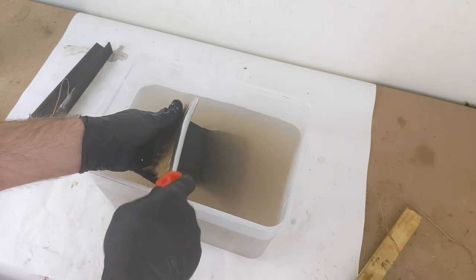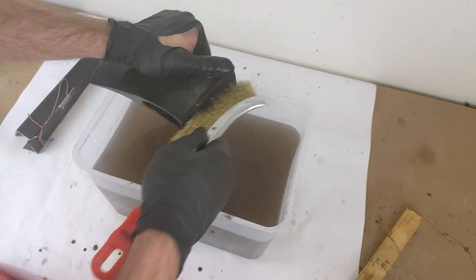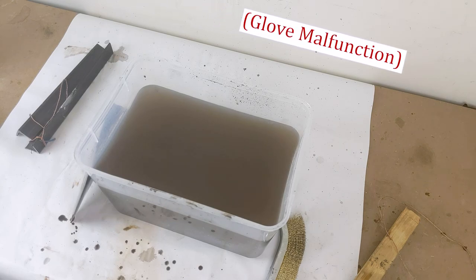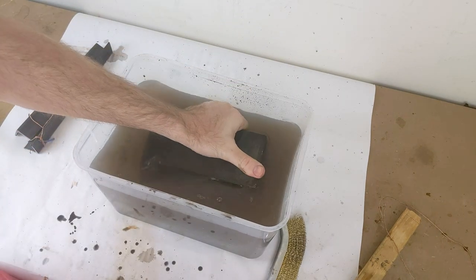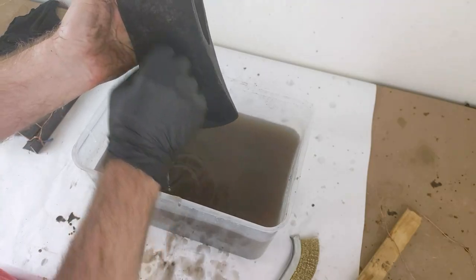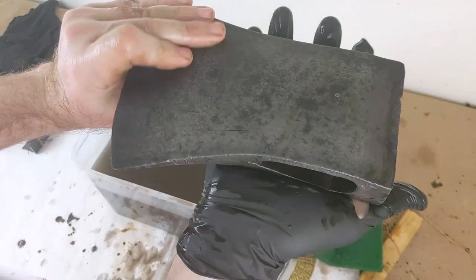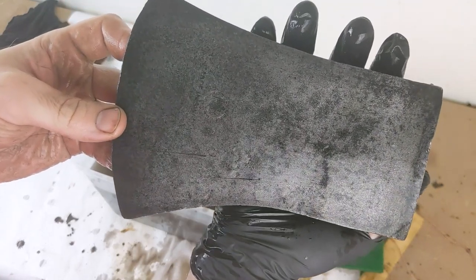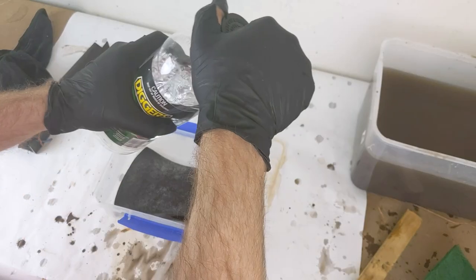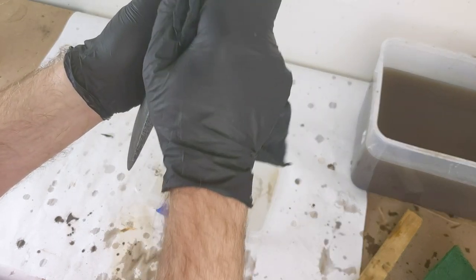There is a black coating on the surface that needs to be scrubbed off, and the entire process must be done quickly. If it is allowed to dry, rust can form on the surface straight away. You can now see why I chose this method over just sanding and scraping, because it leaves so much of the original character. The metal wasn't that pitted and it's cleaned up well — I can even still see the original branding on the steel. A little methylated spirits to rapidly dry the surface; it will displace the water and dry quickly. Everything is then oiled really promptly.